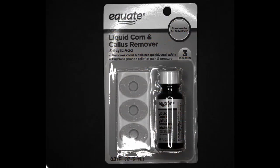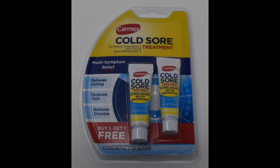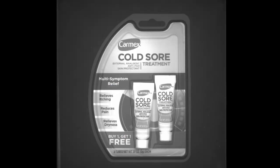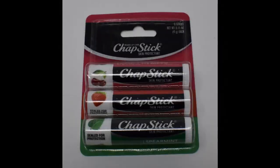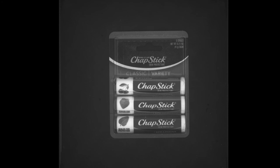The packaged products shown were randomly purchased. The sample images were first taken with the CCS diffuse ring light and then the CCS flat dome. You can see how the angular and round plastic packaging virtually disappears, facilitating inspection of the contents for assembly or package verification.